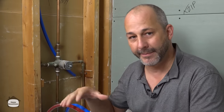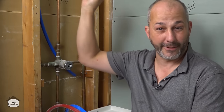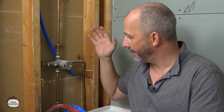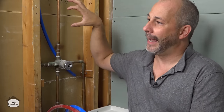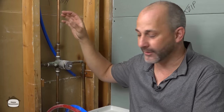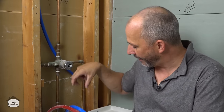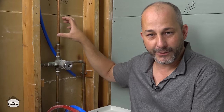So this shower is going to be converted from a traditional two-piece where they had a tub spout and just a shower head sticking out of the wall to a three-way shower valve. And the awesome part about that is we're going to be able to use PEX to run all of our fixtures, because our shower valve has a mixer, so you turn it to the function that you want. So you don't have to worry about if the supply line is big enough to the tub, because we don't have a physical diverter here.